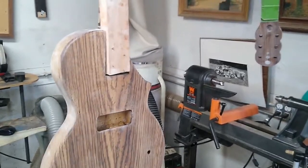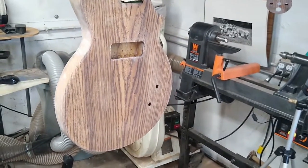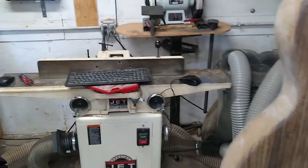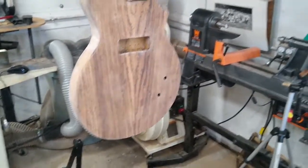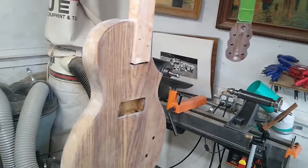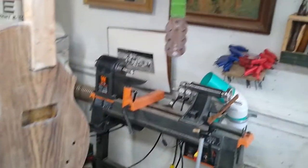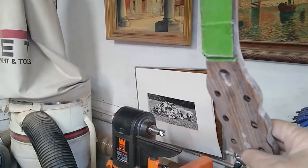And this is where I cut that old audio off, and I'll just voice over it here. I went with the foam brush. He recommended a brush, so I did that experiment. I found that as I used the foam brush and laid it down, it went on thicker than a makeup applicator, but even after a number of coats, it was still fairly thin. I did go out and grab a 2.5-inch brush and use that, and I found that it's a much thicker coat that you can put down and let it flow out, and I saw better results in how the finish flowed out.